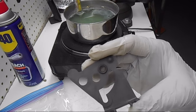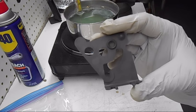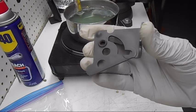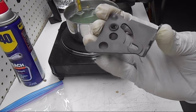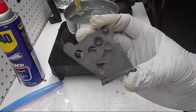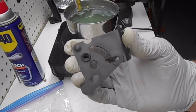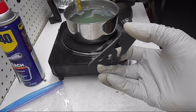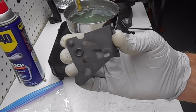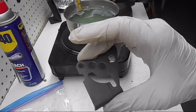I think that's all due to the surface preparation. For gun guys doing ARs and full receivers who want a consistent black finish, that all has to do with surface prep — if your prep is consistent from one end to the other, this will take evenly. Car parts were never that critical about this coating; they just wanted it on there to keep it from rusting. They weren't concerned with perfect uniformity.